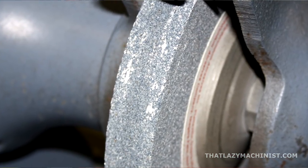The next safety point is mostly for novice machinists: avoid grinding non-ferrous metals on your bench grinder. Most non-ferrous metals have very low melting points and they tend to gall up your wheel easily, meaning metal becomes encrusted in the grinding wheel and it can no longer cut — it just rubs, and that will eventually lead to major problems. Remember, many non-ferrous metals are quite soft and easy to file anyway.